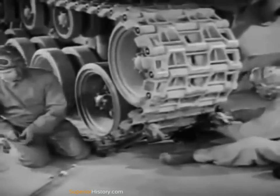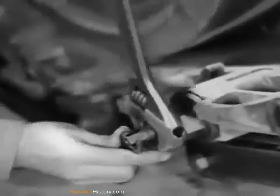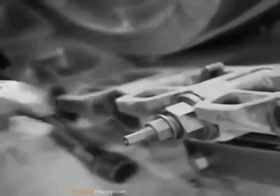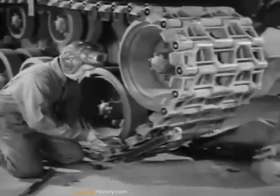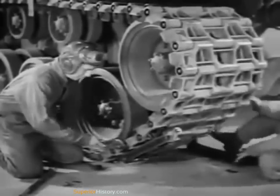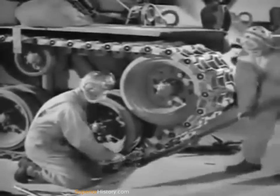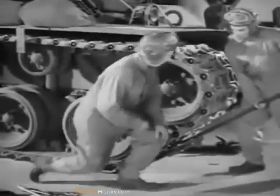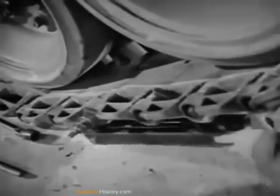Here is the same thing being done on the vehicle. When the two outer bushings have been withdrawn enough to allow clearance for the serrations, take off one of the track connecting fixtures. Now the loosened track must be supported by a heavy bar so as not to damage the bushing serrations. Then the other track connecting fixture can be detached and removal of the track completed.